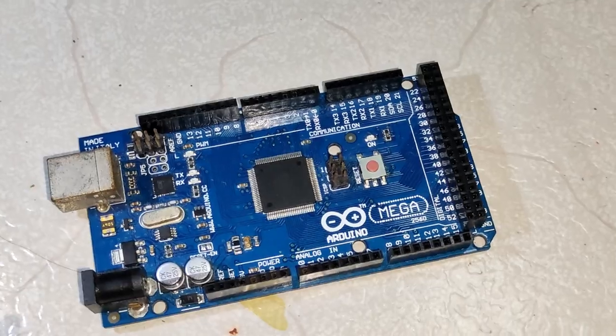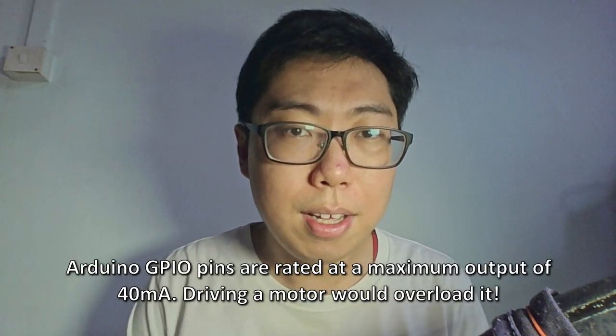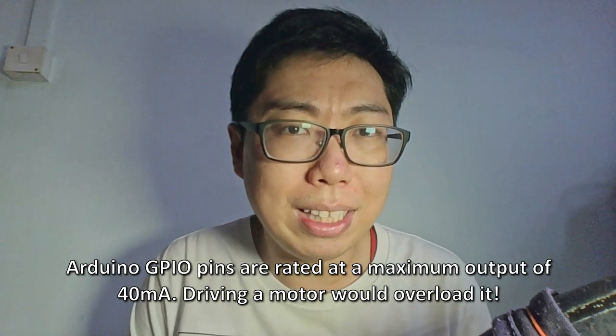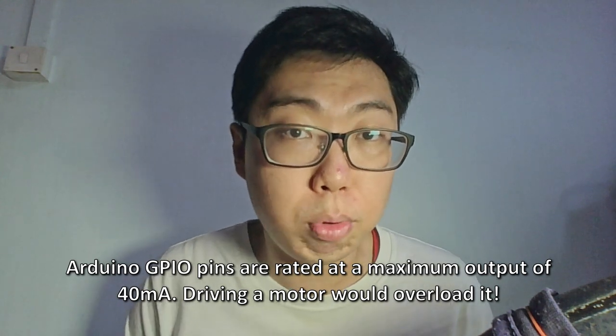The first and biggest problem is you need a fair amount of voltage and current to drive a motor. Particularly on the current side of things, the Arduino doesn't put out a whole lot of current, and making it drive the motor directly tends to be a bad idea because you may overload what the pins on the Arduino can actually provide. So we would like to have some kind of external components to actually control the motor, giving it power from an external source.